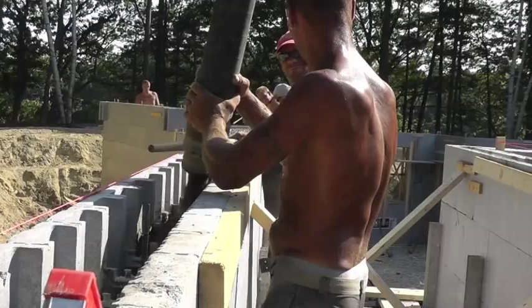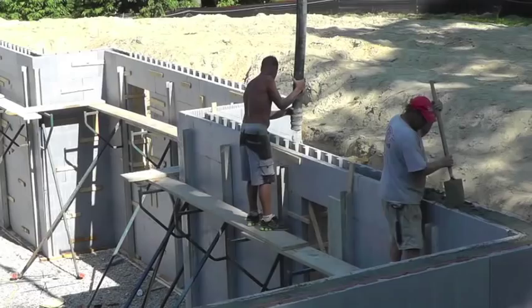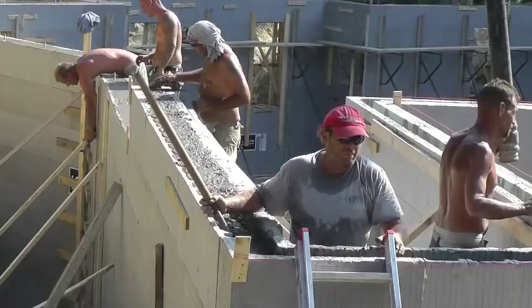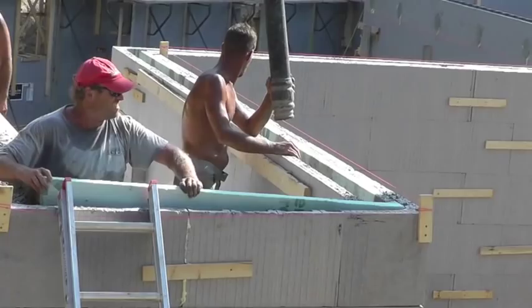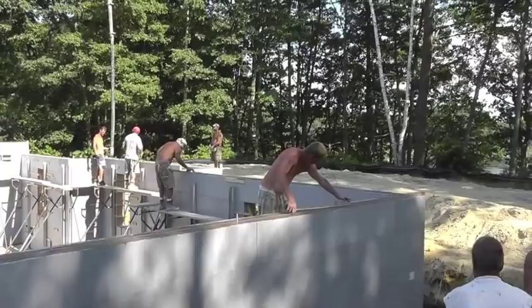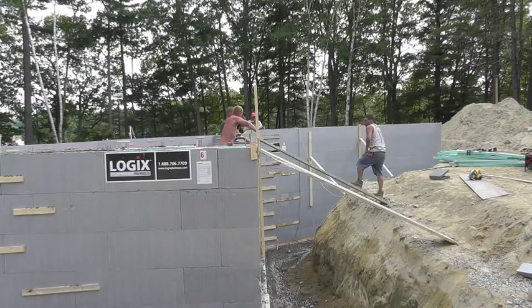We're getting close to the top. It's taken three lifts to fill the foundation with concrete. Pouring concrete and simultaneously leveling the top of it. The strip of green foam is a temporary placeholder to overlap the adjacent garage slab. Karl trowels in a smooth finish to the top of the foundation. Ed measures for the three-foot-on-center wall anchors and sets them into the concrete. Oops — this wall is no longer plumb. It had to be muscled back into position.